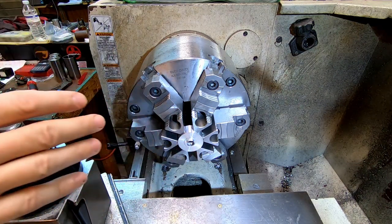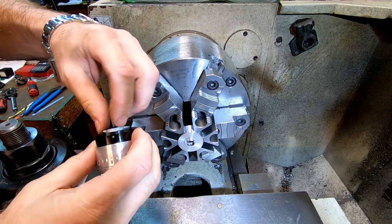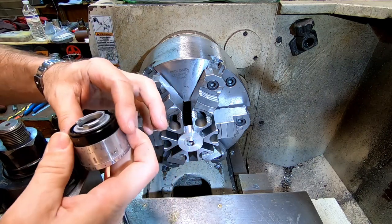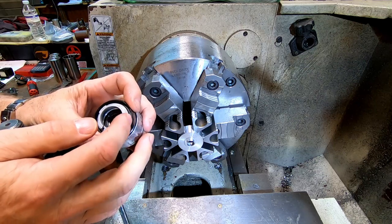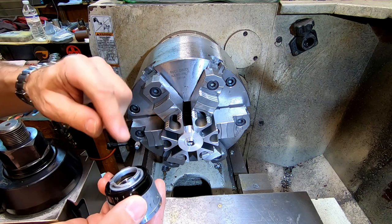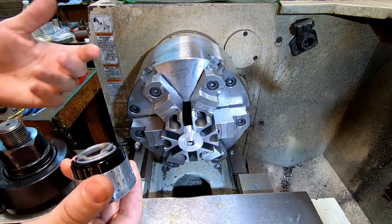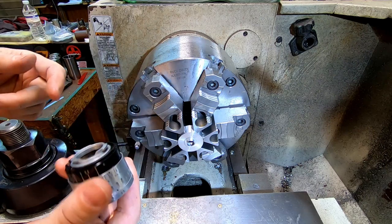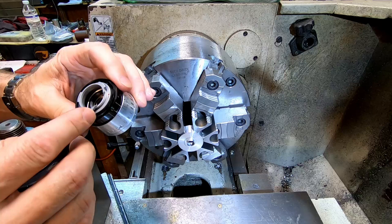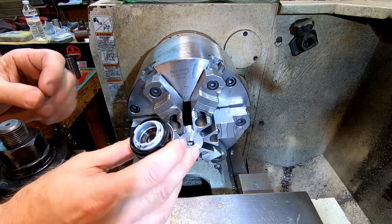This side gets a counterbore that goes up over the flange on the lens, and this goes down to the plate surface where these teeth will go through - there'll be a ring left on the inside and then you can turn and lock it. I've debated whether to run the teeth in a mill or just cut them with a file. I've decided to do it with a file - I can reach through from the other side with a sharpie and mark where they go, or use transfer grease to transfer the locations. It'll be a thin wall of aluminum, won't take but a minute. Save myself the setup time on the milling machine.